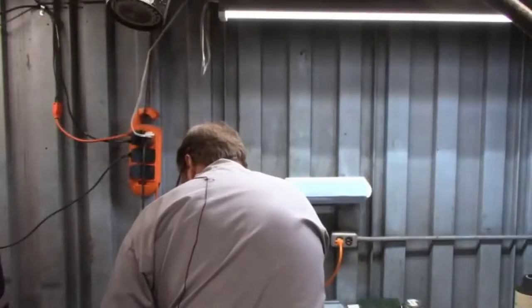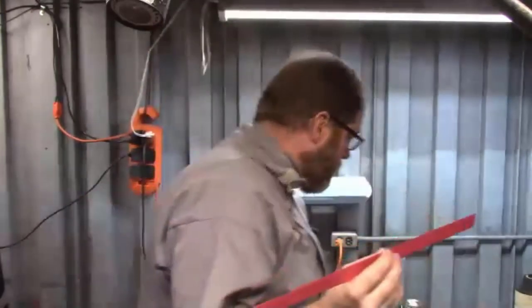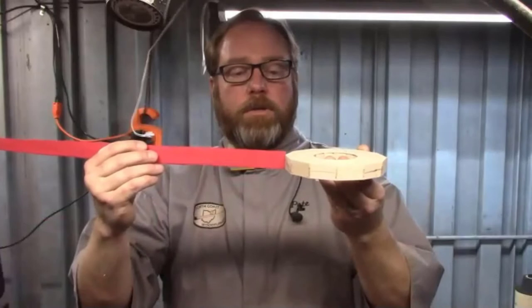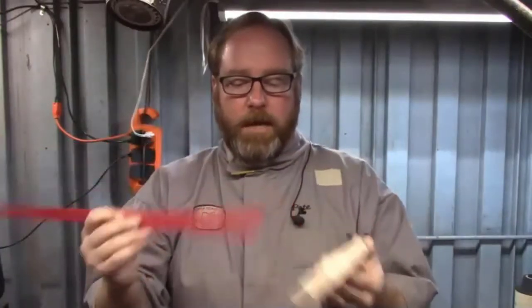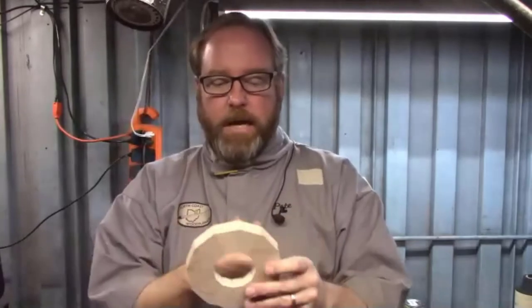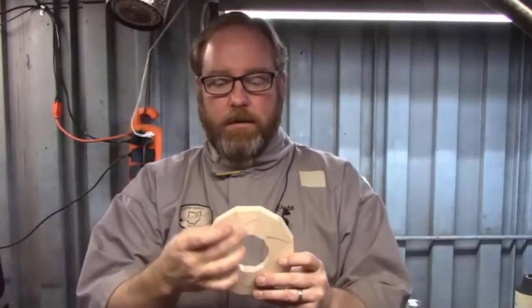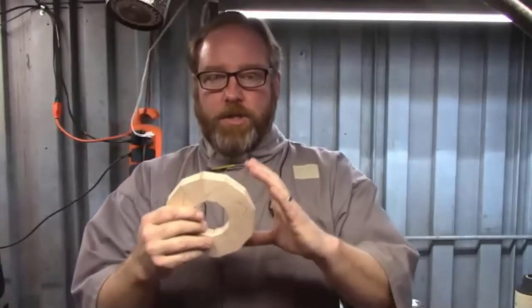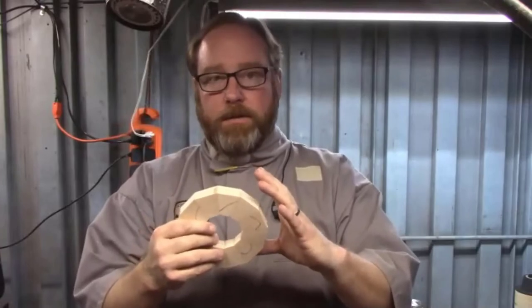So basically what I do is I'm cutting lengths of veneer that will fit between the segments, and they'll have the correct height and everything, so they're sticking up proud. Now, the interesting thing is, and this is all segmented turning, this isn't specific to using the wedgie sled to cut your wedges. Once you have your angles correct, you can add anything you want between the glue joints as long as that piece has parallel sides, so it's straight cut. All that's going to do is increase the diameter of the whole piece by adding that veneer in.